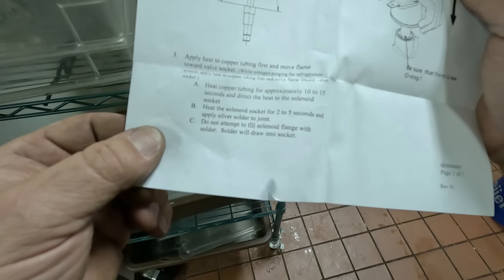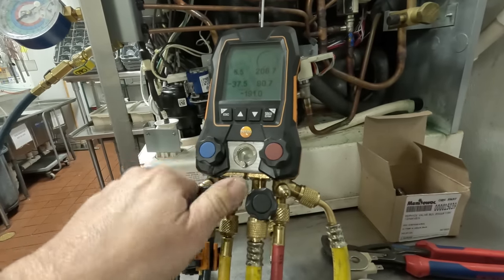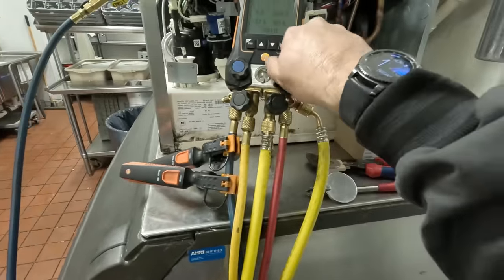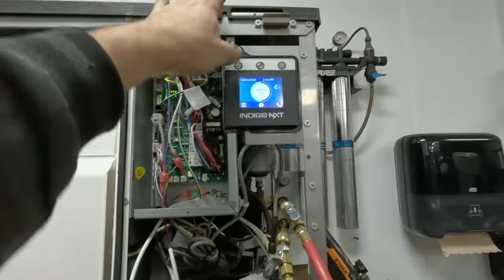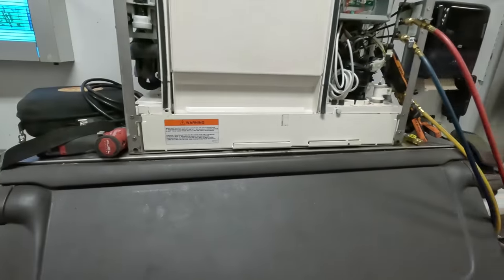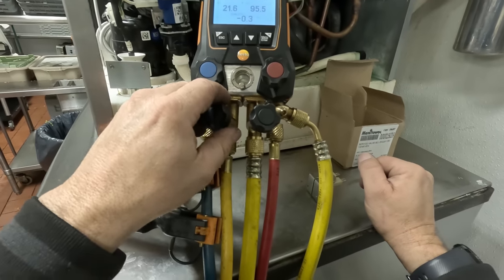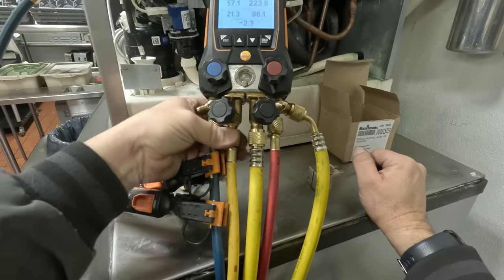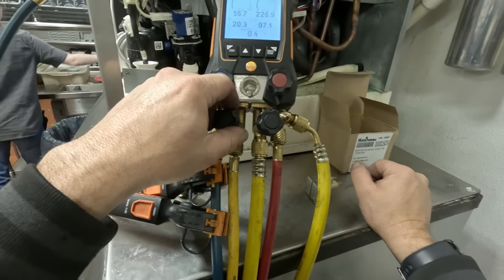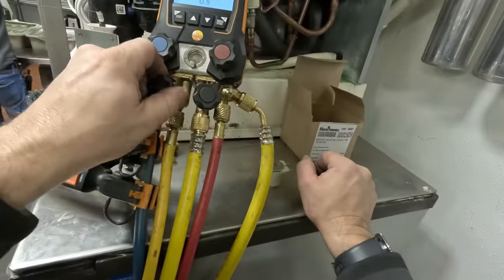The instructions say 15% silver solder is recommended, although silver bearing solder in the 45-55% range can be used. Apply direct heat to the cylinder socket — they call it sockets. It looks like we got 190 ounces in there, so we lost about 10-16 ounces — a pound — that could have been from bleeding and things like that. I still need to add a pound of refrigerant. Already went up on the roof and turned on the disconnect. Let's zero that out and add refrigerant — 190 ounces, we need 10 more. I think I added about six to eight extra ounces, so let's just go ahead and add two more ounces.